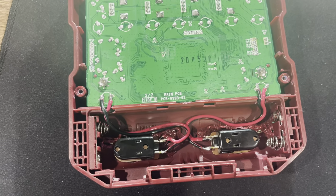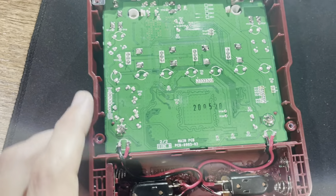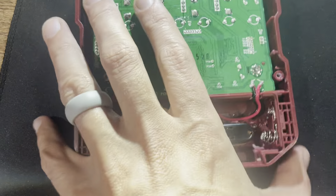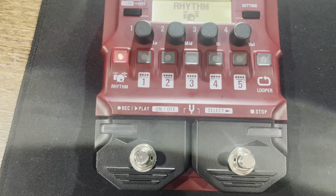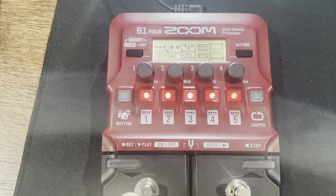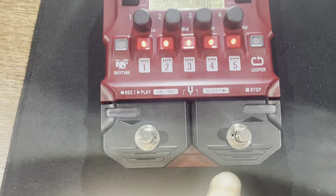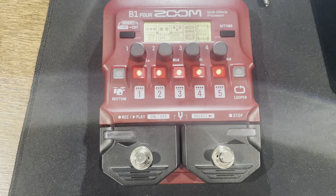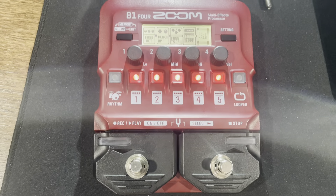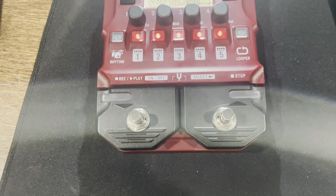Obviously, you can't use batteries now, but in my case I wasn't anyway, so it worked out fine — that's something to consider. Two wires per switch, get a momentary switch slapped in there, and it's a lot more solid of a feel, for sure. It's just rock solid now, everything about it is super secure. Hopefully that's helpful — just remove those stock switches and add in some heavy-duty momentaries.